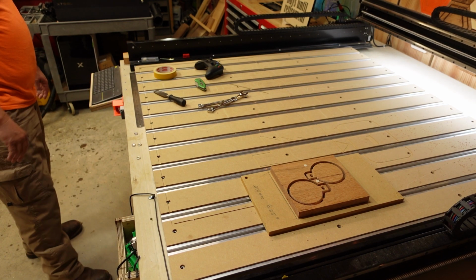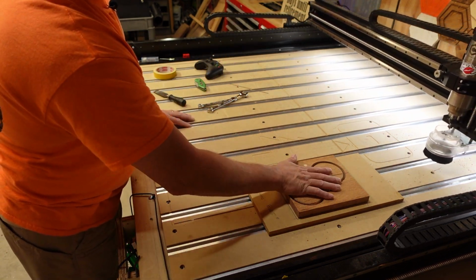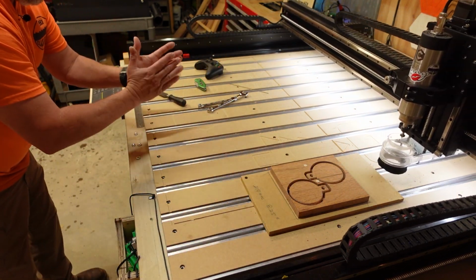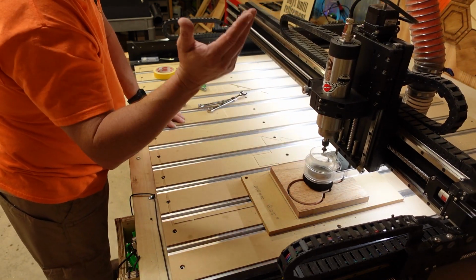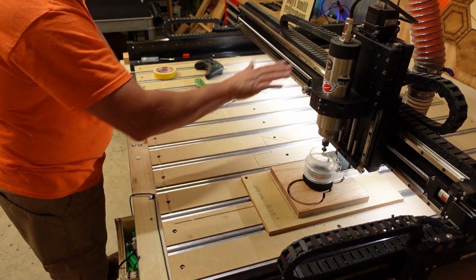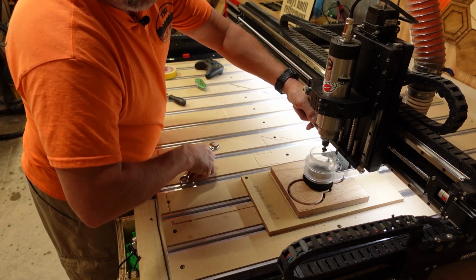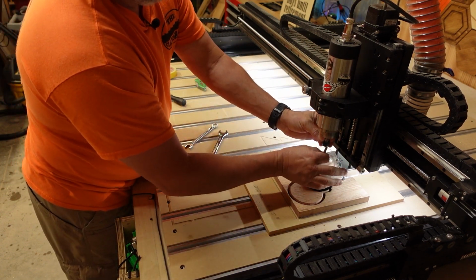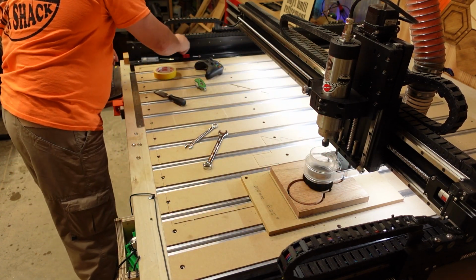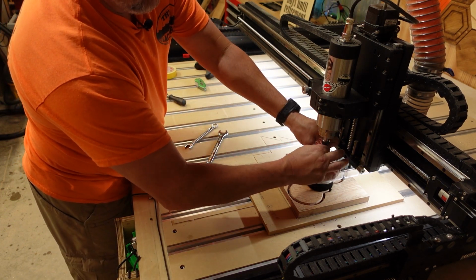Give us that capability. I would like it to be able to set it to where when it finishes a cut, it comes here, so I can change the bit. Or it could just go back to the 0. That's fine too, but I prefer here in case it's a really big job. But I'm setting it to the 0 right now because I can get to it fairly easy, and it allows me, when it gets time to actually set the 0, a little more leeway.